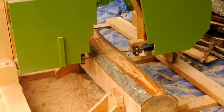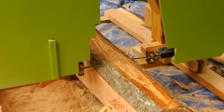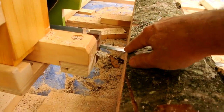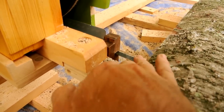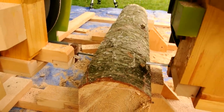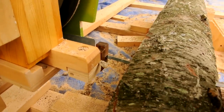Again I'm running into serious blade drift problems. You can really see the blade being pushed upwards. I experimented a bit with adjusting the guides. For the very first time I've actually had the blade drift a little bit downwards. The reason for that is I put a shim in here to aim this blade guide downwards a little bit. So it appears some of my persistent upward drift problems are just that the guides are not quite properly aligned. I'll take some of that spacer out and hopefully that'll work better.